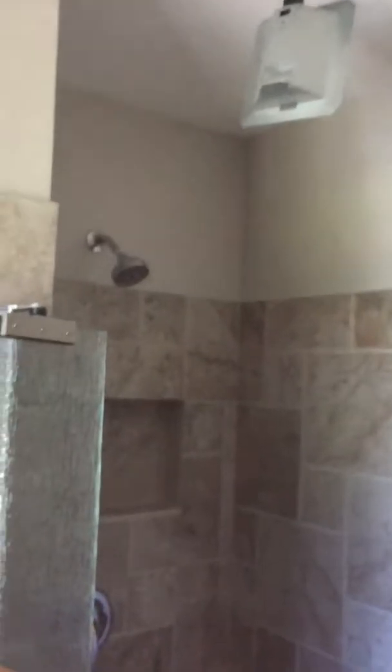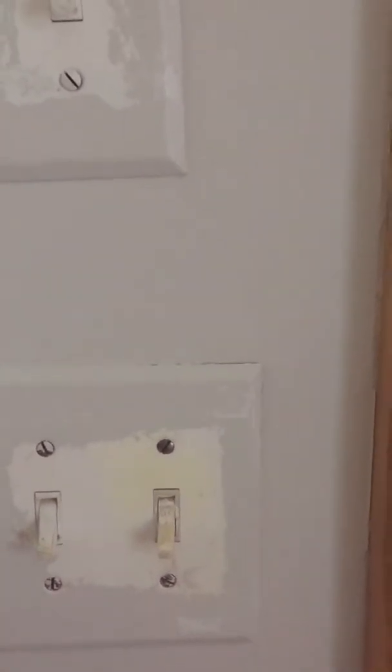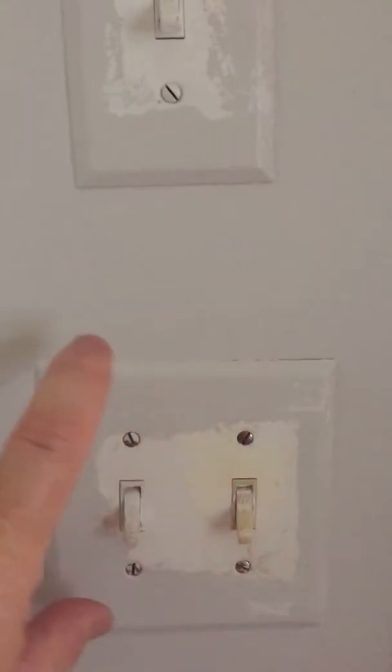Anyway, got a couple little things to do. Get the knob for the shower door and put that up. I'm missing a piece to that. It's a fan-light combo, and it's in the shower, so I've got to either do a GFI breaker or something, figure something out. Gotta get my escutcheons on, my plumbing, place a couple of light switches. Thought about actually putting a GFI plug here that will run that, connected to that fan. I will see. Anyway, that's it.